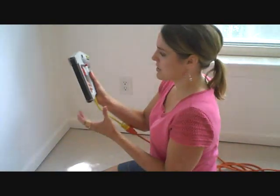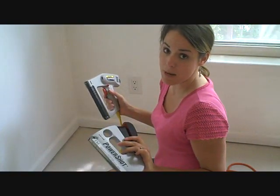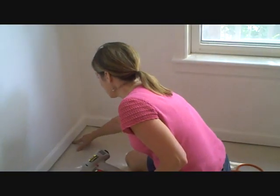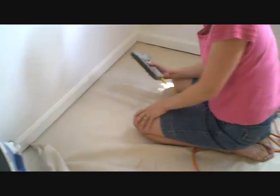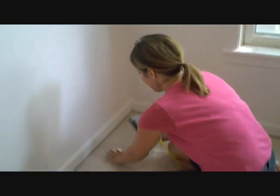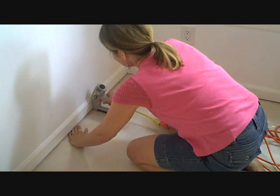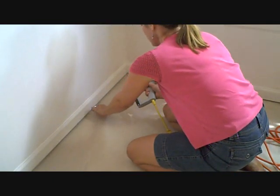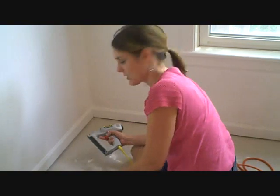What I have right now is an electric stapler that plugs in. I tried it with this manual staple gun but it didn't have enough power to get the staples all the way in the floor. I started in the furthermost corner, and I have tucked just this hemmed area underneath the baseboard and against the wall. If it's possible to remove the baseboard that would probably be easier, but that's something I really didn't want to do here. I'm just pulling and kind of manually stretching as I go and stapling it down, though those aren't going down all the way so I may come back later with a hammer.